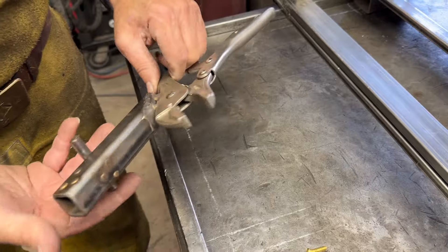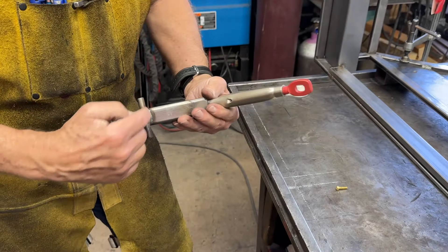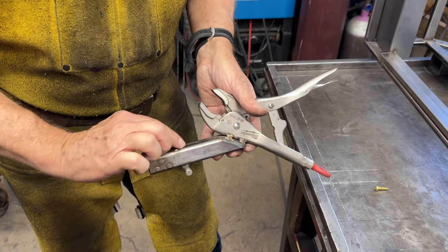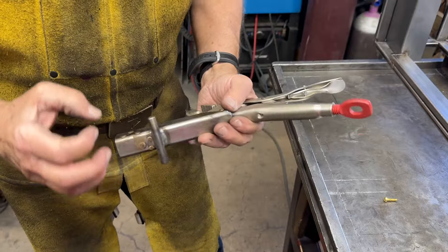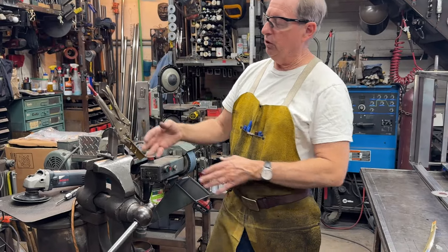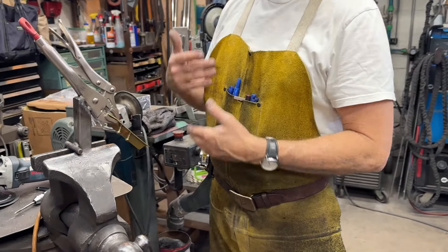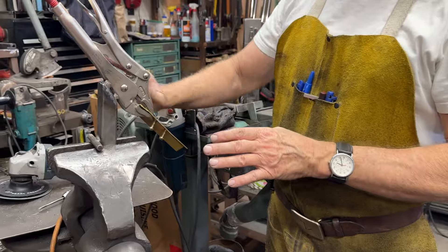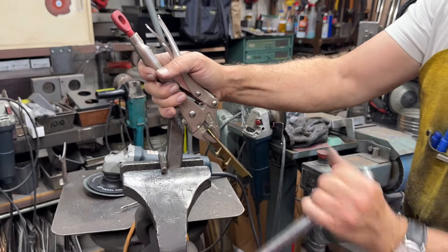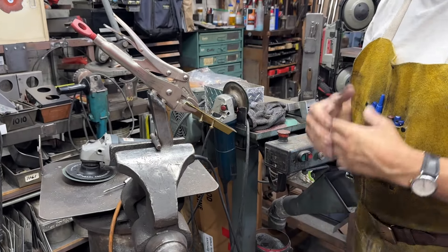All this is, essentially, is a piece of heavy wall tubing that I kept at 45 degrees. I've got a bar welded across here, and I actually TIG welded some little spots on the tube so that it will really grab on a vice. The whole purpose of this tool is when you have a small part and you've got to present it to yourself for various operations of drilling and tapping and sanding and buffing and whatever, you can make this adjustment in such a way that you can put the part exactly where you want it so it's just comfortable to use.